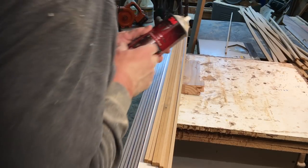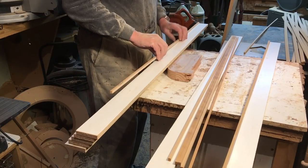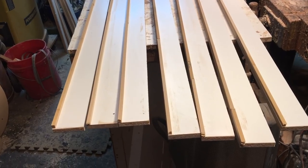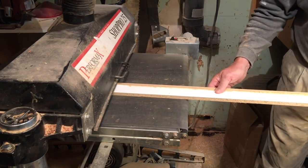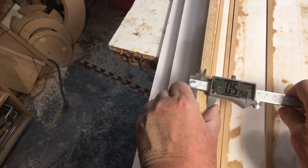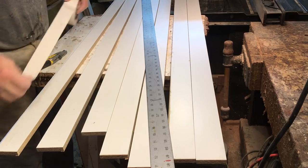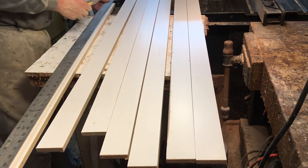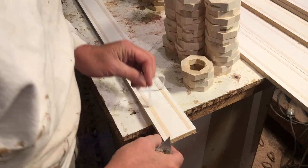The next step is to create tapered rings. I'm going to do that using these melamine trays — they're two and a half inches wide, the same as my rings. I'm putting strips of MDF on here and running them through the sander so they're consistent thickness, about 0.06 inches. It's not that critical for this first pass. Once the shims are dialed in, I'll use double-sided tape — put thin strips, put a thick piece on, and rip it with a utility blade.